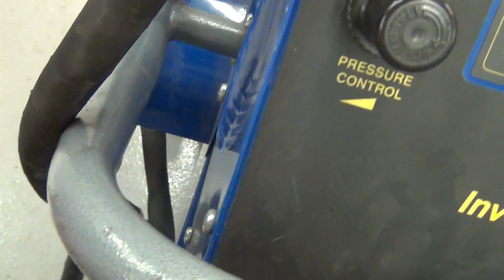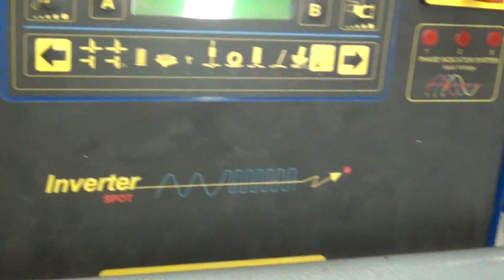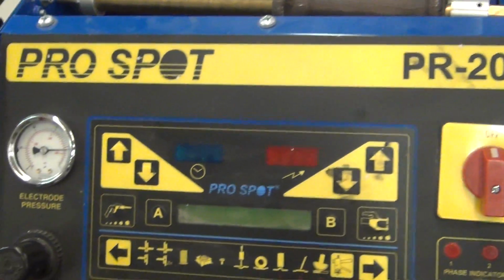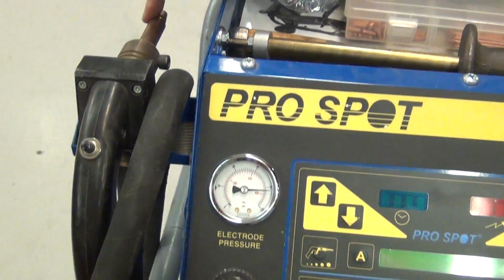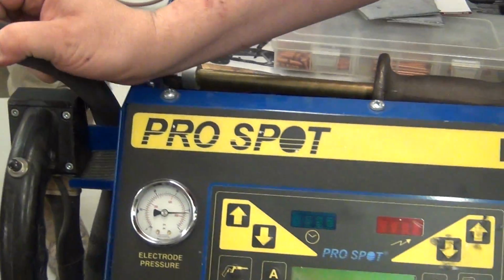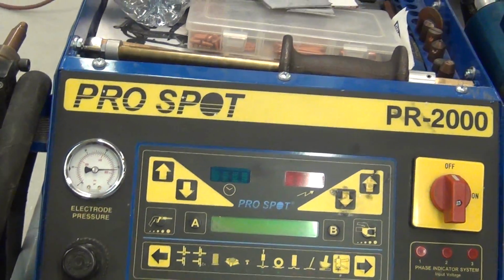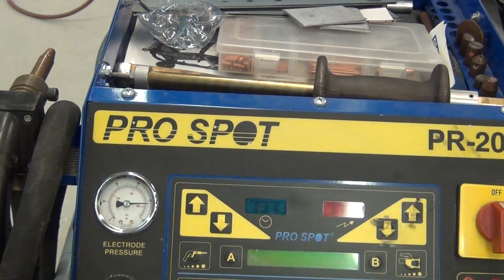This guy here, same thing works with this. It's the ground. If you don't have this in a happy place and you pull that trigger, it will actually blow up this machine because you left it there. I exaggerate. Tell us the truth. If you're touching this and this at the same time, the electric current goes through your body. So if that's hooked up to the car and you're using this device onto the car, make sure that you're not part of that circuit.